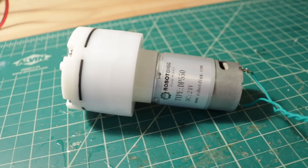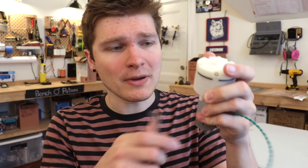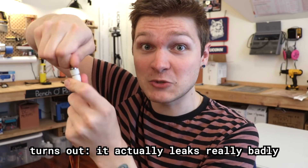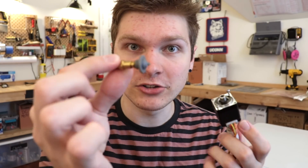This is the one I'm currently using but it's also huge and I'd really like to find a smaller one. From the pump I have some tubing which goes to a press fit between two different kinds of tubing, then this black tubing goes into this awesome little coupler that keeps a really good air seal but can also spin. This screws right into the stepper motor with that hollow shaft and lets you pull the vacuum straight through, and then the little nozzle component threads the other side.